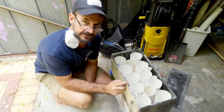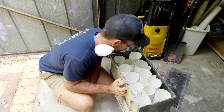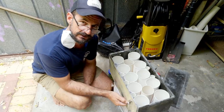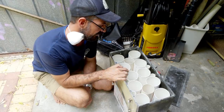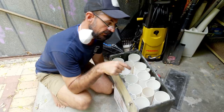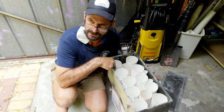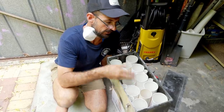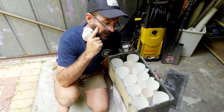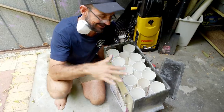So this is our header tank. We had a stainless steel tank. We made a new one out of Thermalite and epoxy, and having a look in here, we can see that diesel has no effect on epoxy whatsoever. PVC pipe and diesel have really high compatibility — you can check that out online. So we were really unhappy that I didn't make this a baffled tank. I didn't make it a baffled tank because it was so small. We can hear a bit of sloshing, and I want to get rid of the risk of aeration of diesel. Also, this sight glass is incredibly hard to read while the diesel's moving around so much.